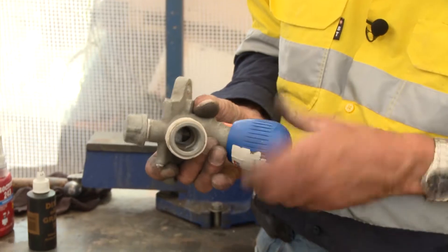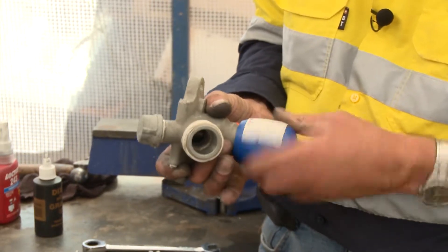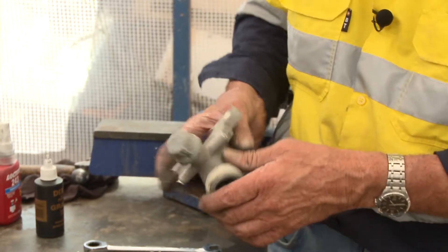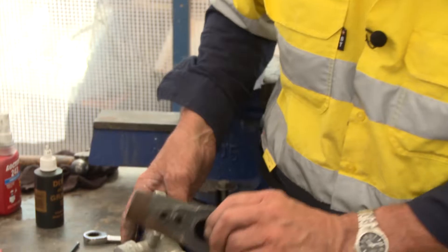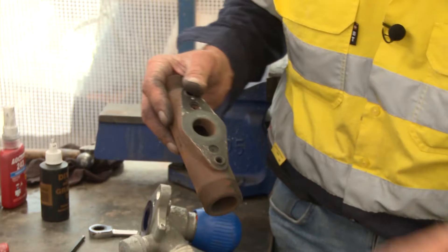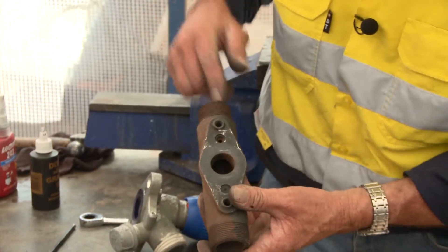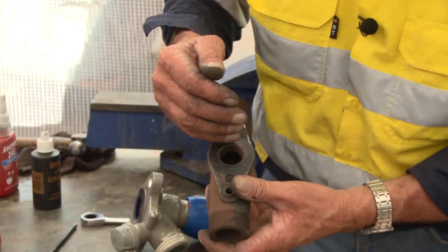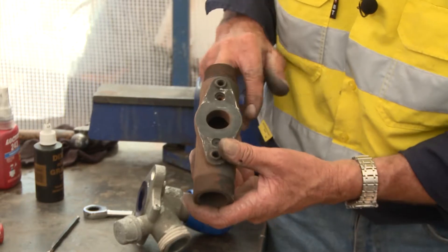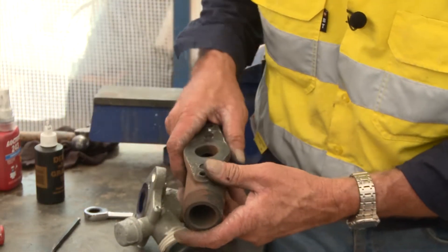In relative terms, if you open that all the way up, you're leaving yourself open to all sorts of incidents and accidents, because the air has to have the capacity to move that grit out of that tiny area. If you have it flooding in there, the air coming through hits that grit and immediately it becomes a baffle due to resistance - just like the baffle in the muffler on your car - and it slows everything down as it exhausts.